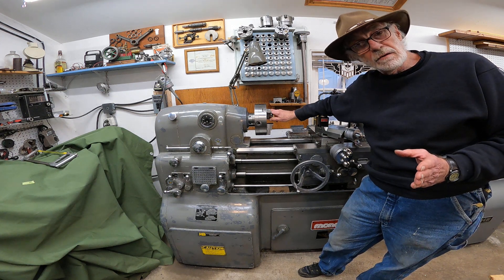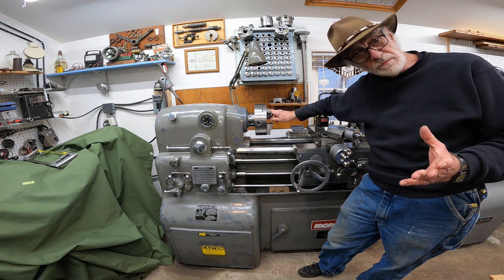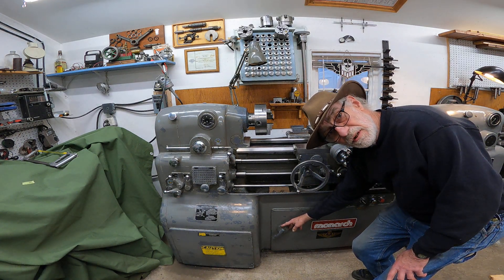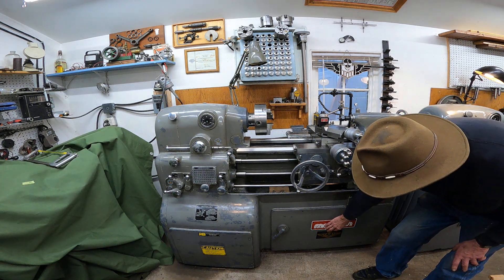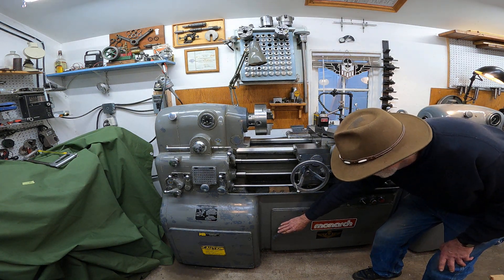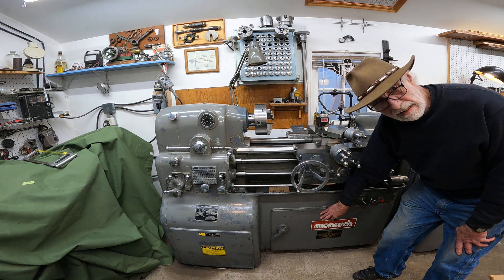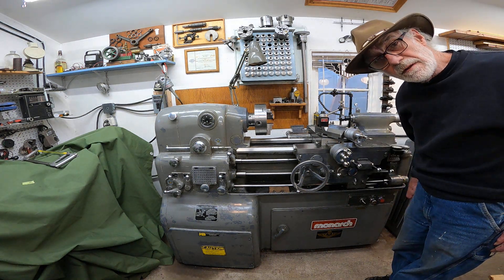At a glance, if you're looking at photos, the vacuum tube module drive machines — which are easy to work on in my opinion — will have the disconnect switch right here. The later machines, 1984 and later, moved the switch in here, and sometimes here, but it's no longer there. So if it's located anywhere else it's the solid state regenerative drive, and that's a hard one to keep going these days.